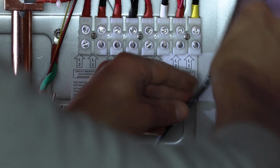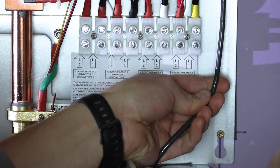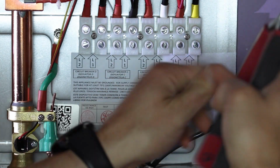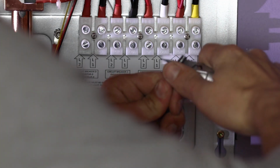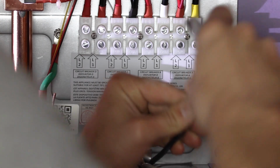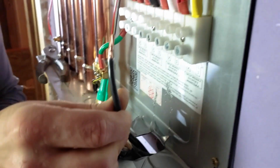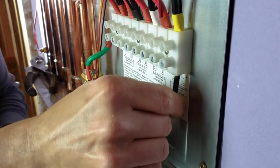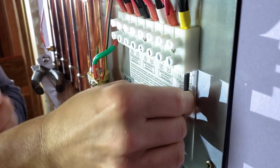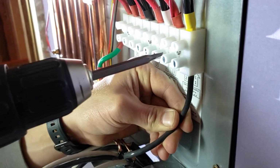Grab any one of the 4 black wires that you have sitting in front of you and line it up to the terminal all the way to the right. Essentially, black wire goes with black wire and white wire goes with red wire in this case. Go ahead and strip off about 1/4 inch of the sheathing on the very edge of that black wire and insert it into the terminal with the corresponding wire. In this case, the corresponding wire just above it is black.